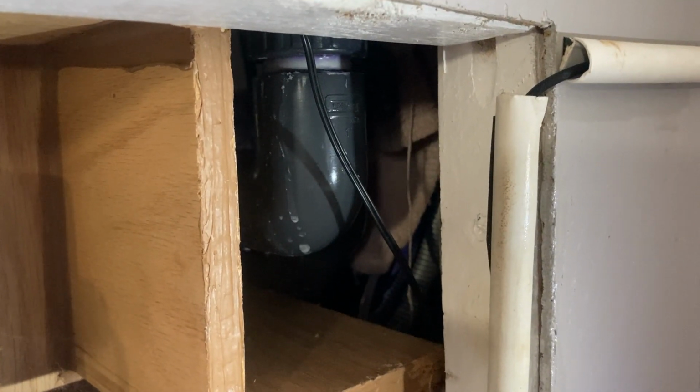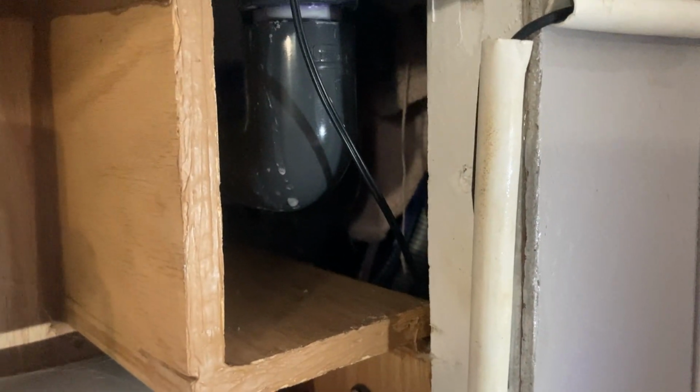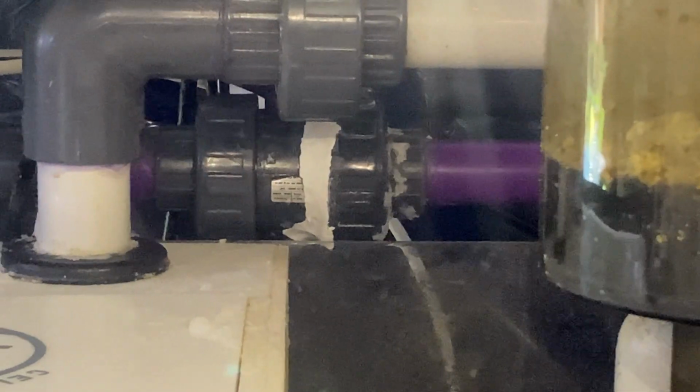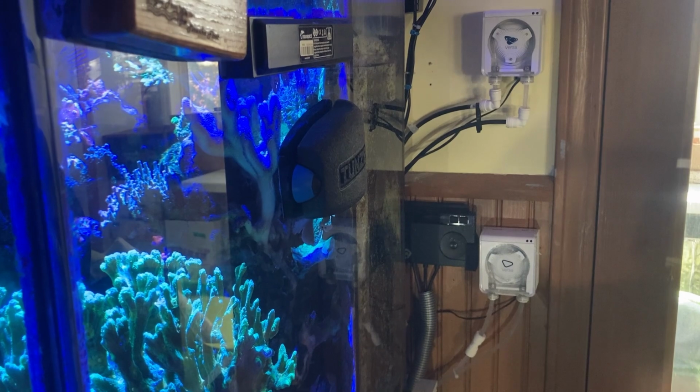I built the cabinet in a fashion where I could access both bulkheads. I recently had to fix a leak in a True Union over leveraging the manifold that led to that bulkhead, which produced a fast drip in the right bulkhead. Unfortunately, it hadn't cracked, it just needed a bit of tightening. I ended up using JB Weld to patch the union rather than replacing the entire manifold.